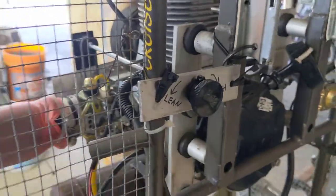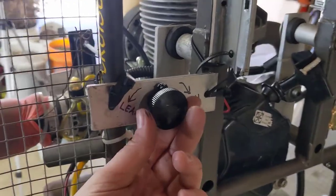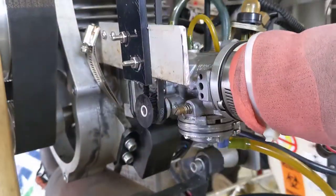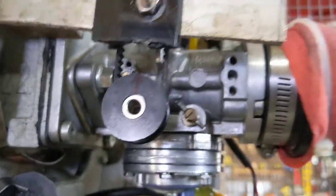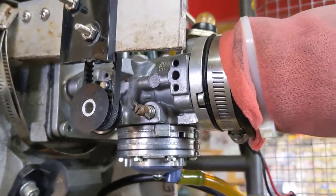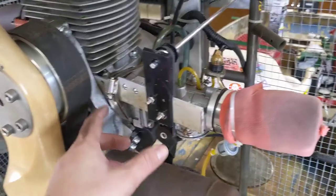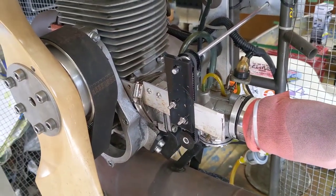After a lot of screwing around and a lot of false starts, I made some brackets for this adjustment device, and I can now adjust my carb needle — at least the low-speed needle — from up front. I've got my little gears and my little toothed belt, and I can adjust this needle from up front now. The high-speed is going to have to wait; it doesn't need as much screwing around as the low-speed idle needle needs, so knock on wood, I don't need to make another adjuster for that high-speed needle right now. I'm sure there's a better way to do this than my hacked-together redneck bracket, but I'm going to see how well this works. I see a lot of guys on YouTube with CNC routers, laser cutters, 3D printers, lathes, and mills to make custom brackets like this — I don't have any of that stuff. I got some power tools I found in the trash. I got a trashy airboat. Let's see if it runs.